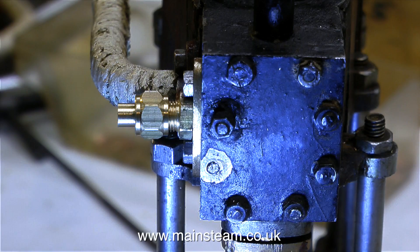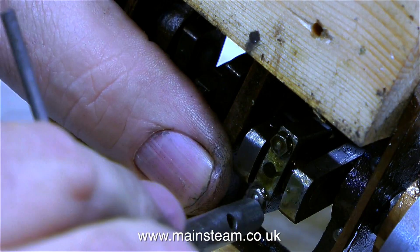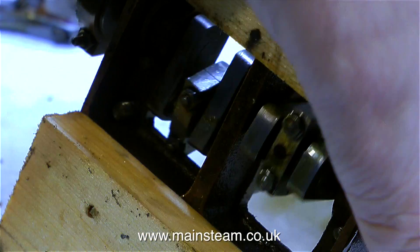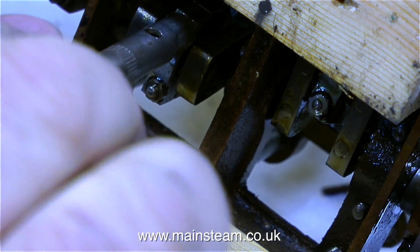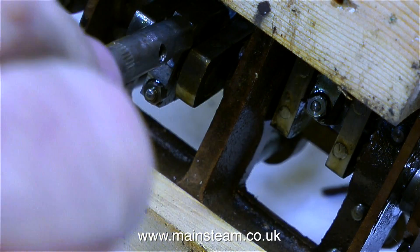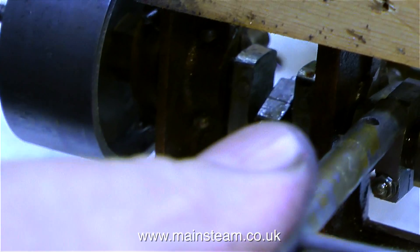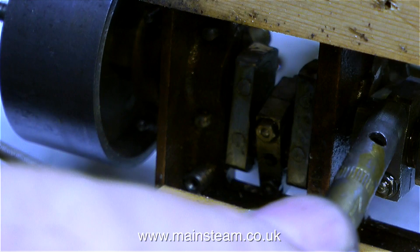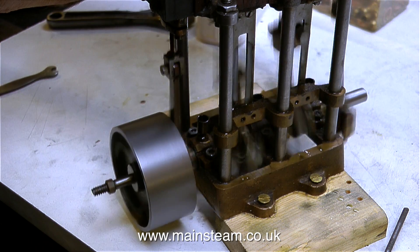I'm going to have to have the steam chest cover off to fix the stud — I don't think that's going to be too difficult. I'm just checking how tight the big ends are. I've been very careful not to over-tighten and over-stress the bolts, but they are quite slack. When I tightened up the bolts, the engine stiffened up slightly, which means the big ends are not hopelessly worn. This engine is never going to win a concourse competition, but that's not what it's all about. I'm pleased to see the crank webs are successfully pegged. I still don't like the wobbly flywheel and I will be addressing that shortly — but that could be something to do with the amount of play in the front bearing.